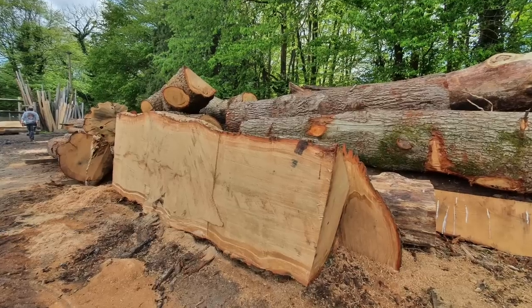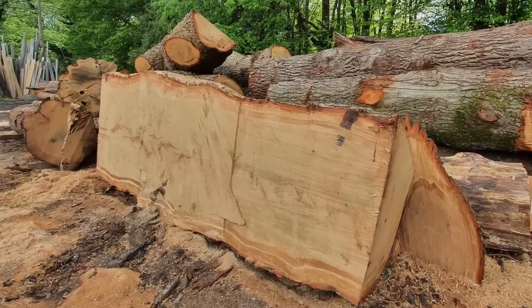So I like to find something that's been cut down maybe for a couple of years, maybe been ripped out of the log, if you like, for at least 6 months. So it's got a little bit of stability to it, because the moisture content is generally high for live edge materials. So I found a lovely bit of beech. I'm gonna cut it down and basically prepare it, which is a very easy job. I've got to straighten one edge, cut it to length, so remove both ends, shoot it in, drill through for a big enough hole for the waste, and just prepare it and let it dry out.